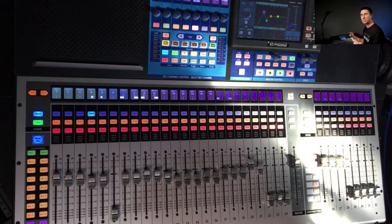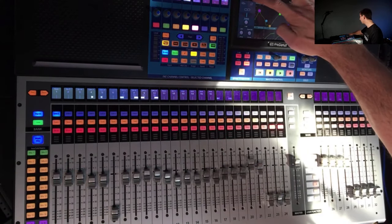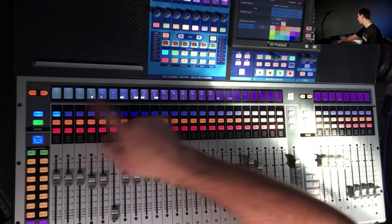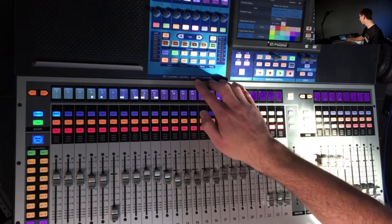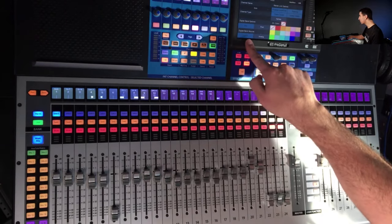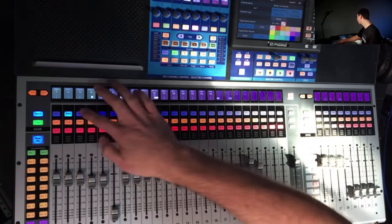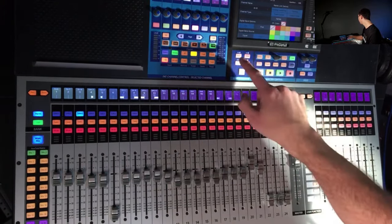That's what you want. But we're going to do things a little bit differently, and we're going to switch it to our USB input. So on all of our channels, we're going to hit the USB as our primary input. On this channel, we're going to hit the little gear wheel up here. Now, when we hit USB as our channel input, now we have digital send options, which we'll talk about in a second, but our digital send source, we don't want to be digital, we want to be analog. So we're going to go through, and on all these, we're going to switch that from USB and our digital send source to analog. What this does is it sends the signal from the XLR straight to the analog to digital converter.